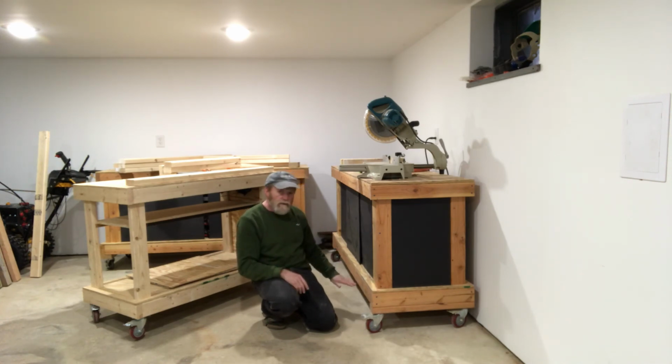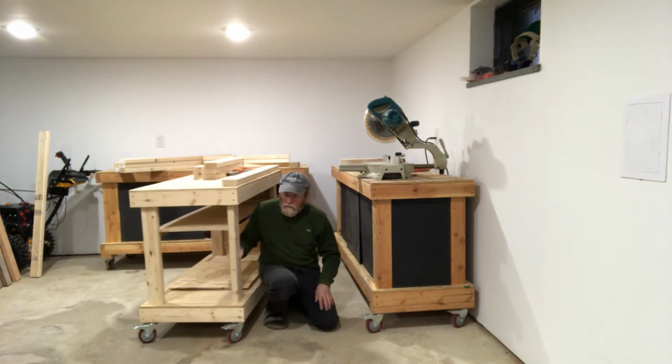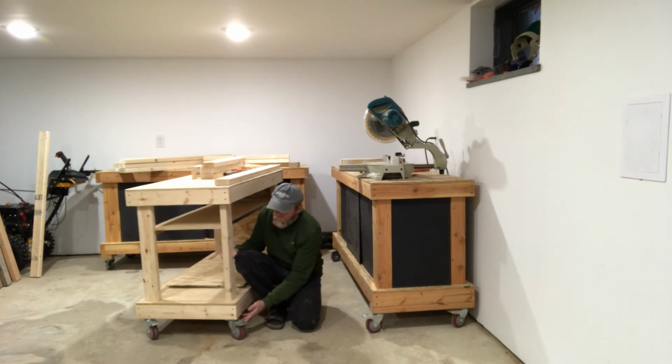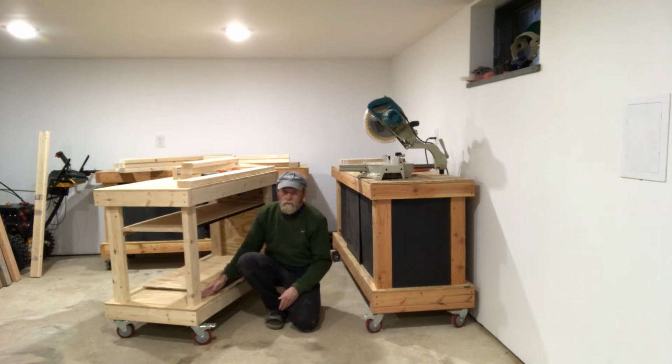And that way these will slide right in there, no problem. The deficiency is you lose 1.5 inches of height here, so when you're putting things in, you have 1.5 inches less. This one right here, the casters are mounted directly to the base. With this upright here, there's still plenty of room for the lag screws to mount into, so these are still plenty strong. They are a little bit lower to the ground, but I do get an extra 1.5 inches here to put things in.